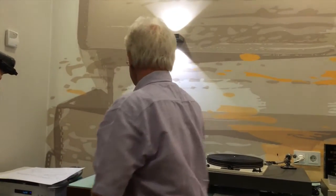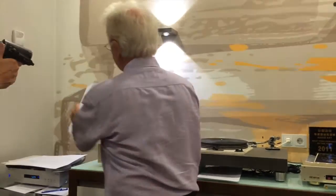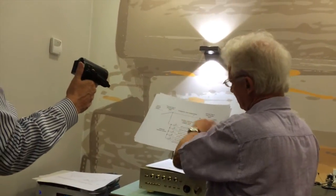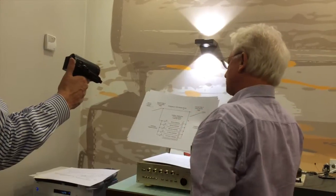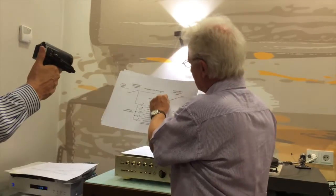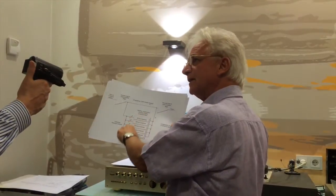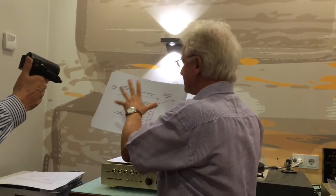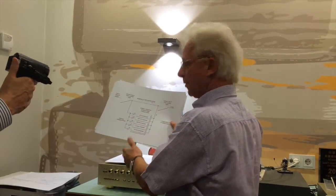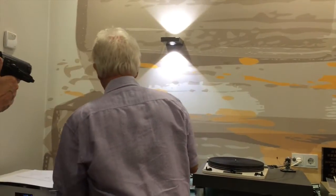Now, we do something much simpler, or in some ways simpler. We let the signal pass through from input to output 100%. And then we have an additive subtractive constant phase linearizer pattern. What this means, we subtract or add to the straight-through signal only those critical areas of the frequency spectrum we need. The center frequency is set at what you can read here, 50, 200, it's just 2 octaves apart. But the unit is much more versatile than this.